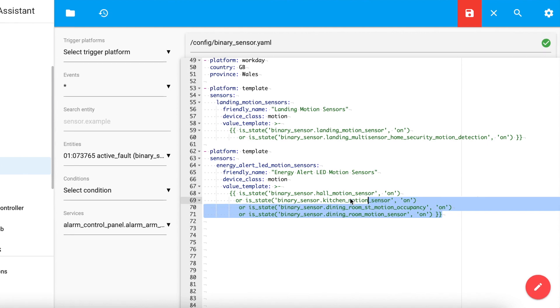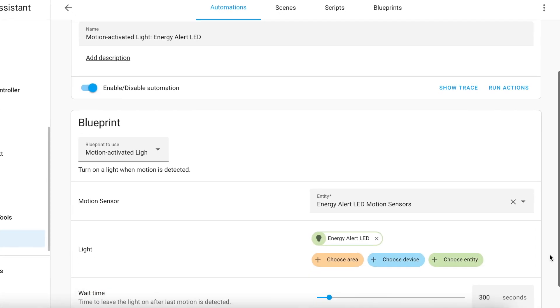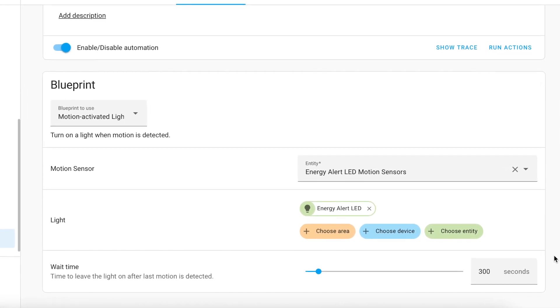This works great for me, but I wasn't quite happy with the LED being on all of the time when there's nobody around to see it. I made sure that the sensor exposed the LED back to Home Assistant, so I created a new automation. I grouped together motion sensors from our hall, kitchen, and dining room as a template binary sensor, and used one of my existing automation blueprints to turn on the LED when that group detects motion but turn it off a few minutes after motion has stopped. I'll put that blueprint code, the associated automation code, plus all of the code for the traffic light sensor on my website — just follow the link in the description.